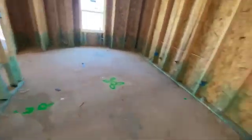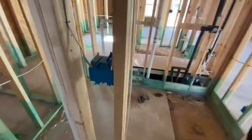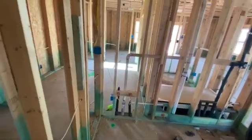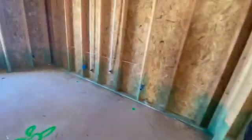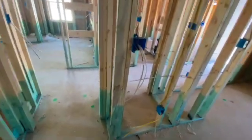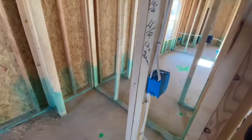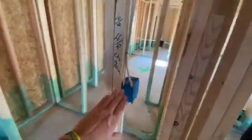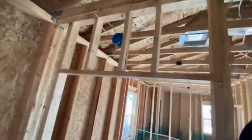So that's pretty much the setup when you come into a residential setting on the bathrooms and the bedrooms. We tie the receptacles together — you're up to eight receptacles, eight devices in New Mexico; I think it's 10 NEC. We'll put this bedroom all by itself. There's your home run, there's your lighting. With our lighting, we brought a 14-2 15-amp circuit for lighting. We grabbed all of our lights to the bedroom. So we go from here and then jumped over to the closet and put the light above there.